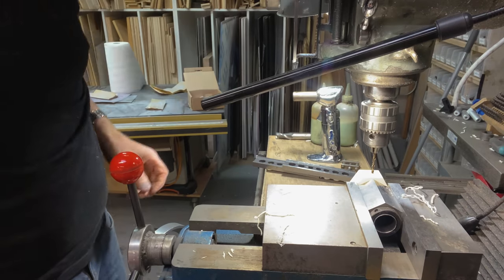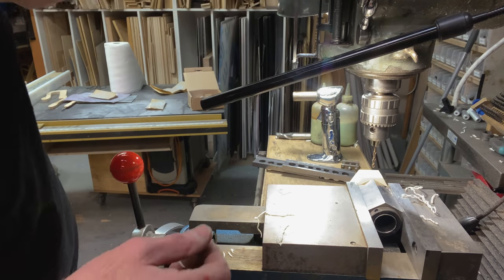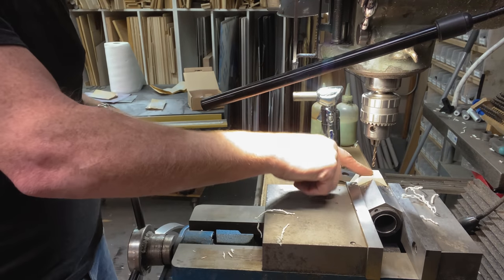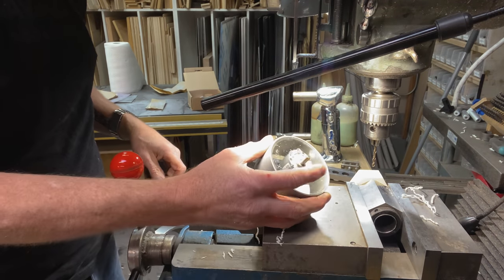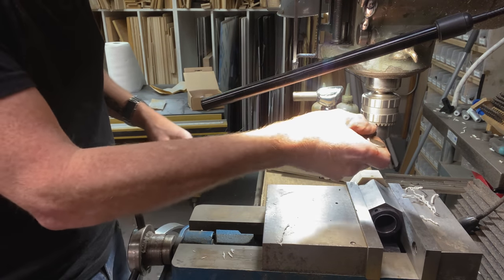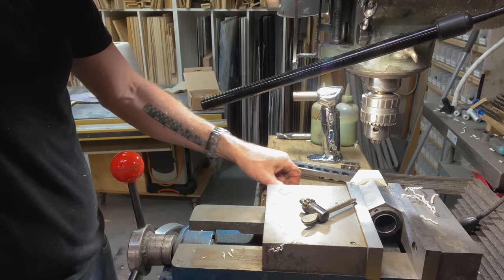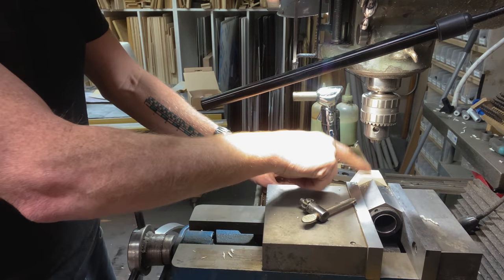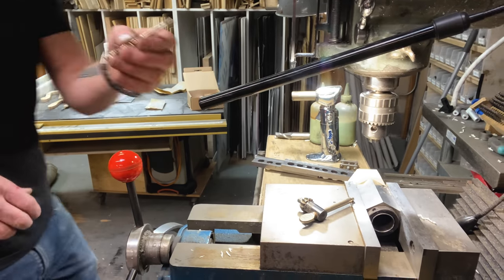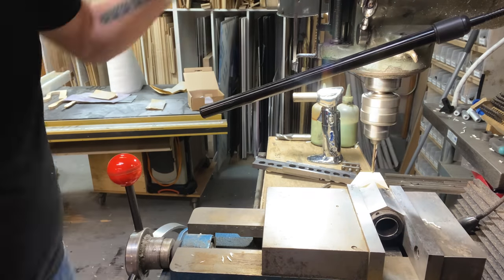That's my tap drill for the tightening against the shaft of my motor there. Now I'm going to drill a center hole for the magneto pieces. And since I'm going to screw those in using 1/4-20 bolts, I am going to use a number 7 drill, being the tap drill for a 1/4-20 tap.